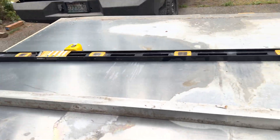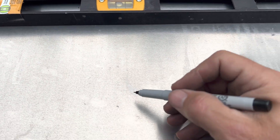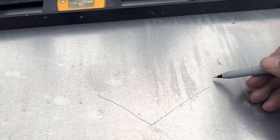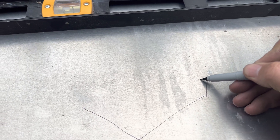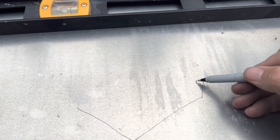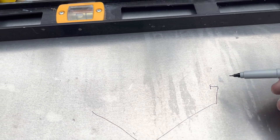I'm going to get those cut and get them down to the shop to have them press brake the top. Essentially, this is the bottom of your boat, and your sides come up like this — they usually lean out and then you put a little gunnel into it. So I'm going to take these in and get the bends put in, as well as the transom. I need those cut and brought to the shop, especially the transom, before I start doing anything else.